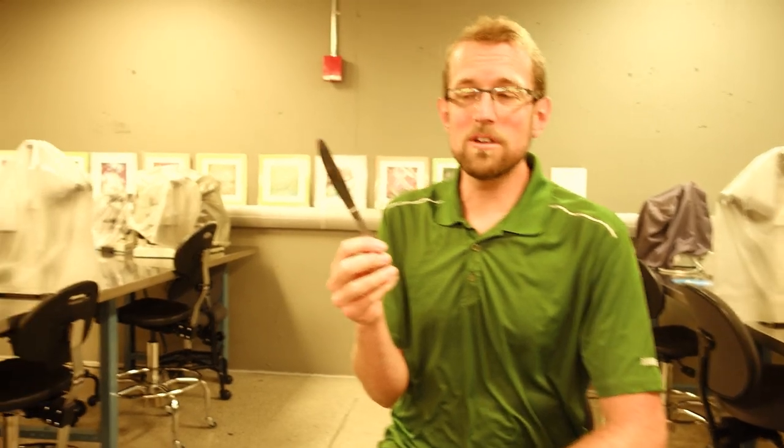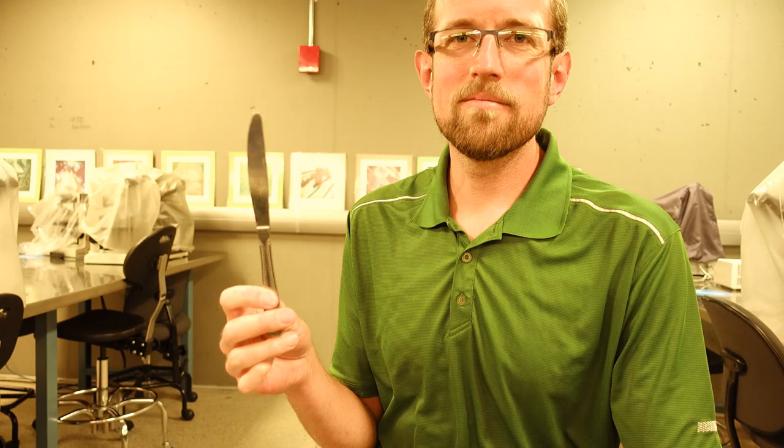Technically, this would be a ferritic stainless steel. Maybe we'll cover what that means in a future video. But for now, we're just going to take a look at the hardness of this sample and then quench it and see if our hardness has gone up or stayed the same or what. So you would expect the hardness goes higher if it was carbon steel, right? Most steel, that's true. You quench it and you get a very, very hard structure, yeah.